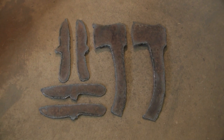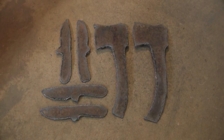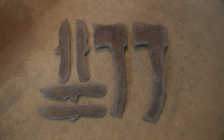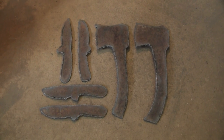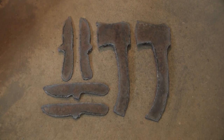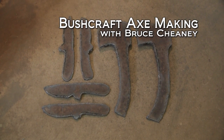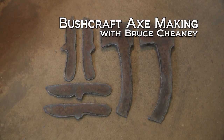I've got the pieces knocked out of the disc and there's a lot of slag on the backside of those pieces, so I'm going to grind those off on my 2x72 belt sander. Then I'll heat those pieces up in my propane forge and straighten them and get the arch out of them on the face of the anvil.